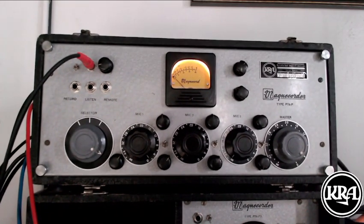Yes, I think that's everything. I think that's everything that I've done to this mixer so far. I love it. I think it sounds really good. There is a slight roll-off of the very high frequencies, and I think that's probably due to some of the values in my mixing network. I might try out some other mixing resistors and see if I can claw back some of those high frequencies. But overall, I really like it. I think it sounds really good.